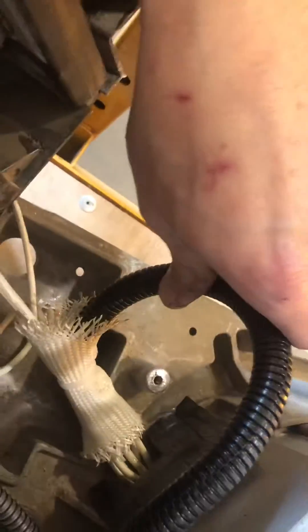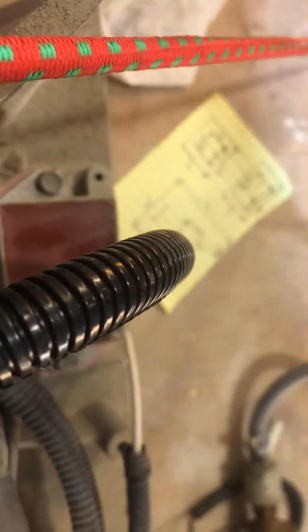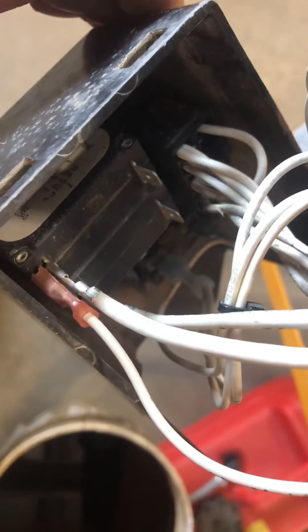You'll have six wires in total: two battery wires that connect back here, two ground wires on the eyelet right there, and then the other wires which come forward — T4 and T1 — and then your CB1 line which is connected to T1. That's connected to one side of your breaker, and when you finally put this back on the base, these other two wires here will connect to the other side of the breaker.